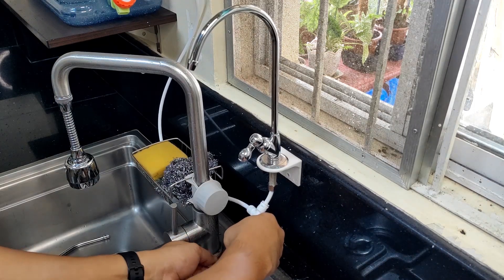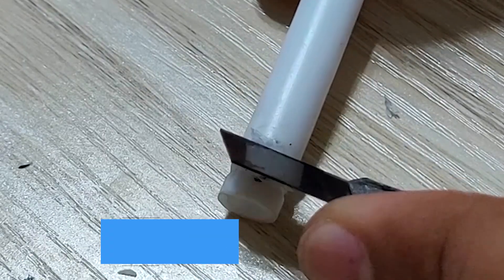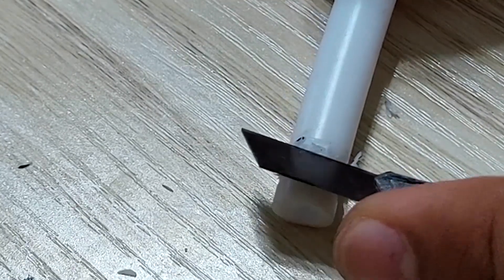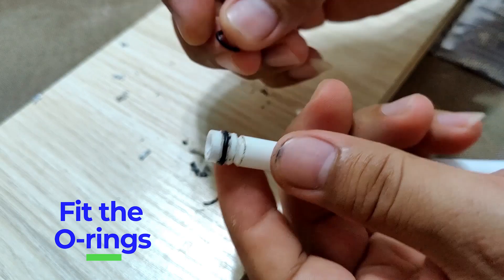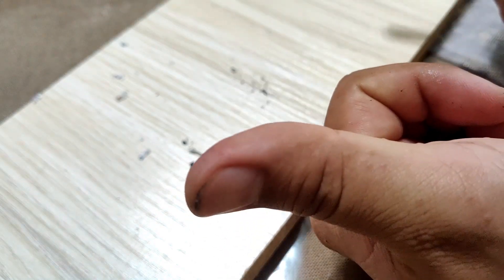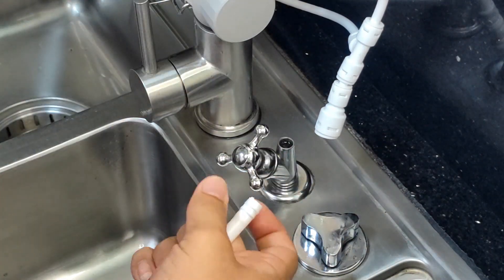To correct the leak, I have to fit two seal rings on the hose because Teflon tape is not enough to stop the water pressure. If you don't have the O-ring, you can use the old seal rings from the old faucet. Mark and create two grooves for the seal rings by using a cutter and a soldering iron. Be careful not to cut too deep on the groove or it will cause a leakage. Fit the two seal rings.